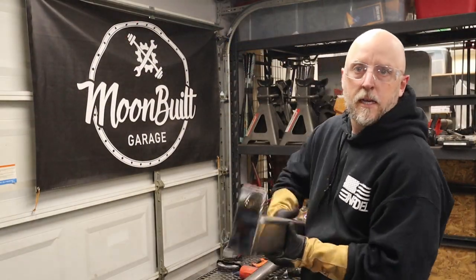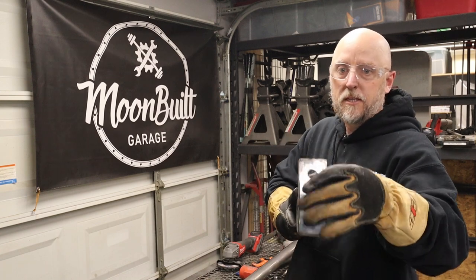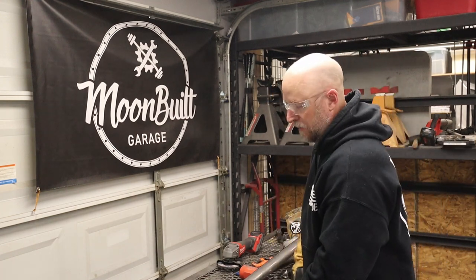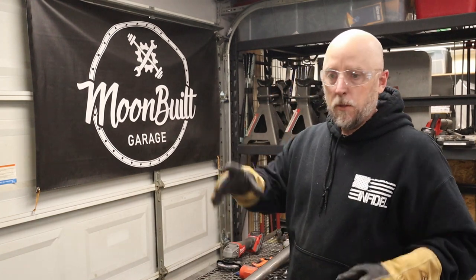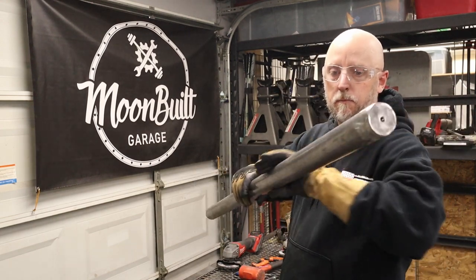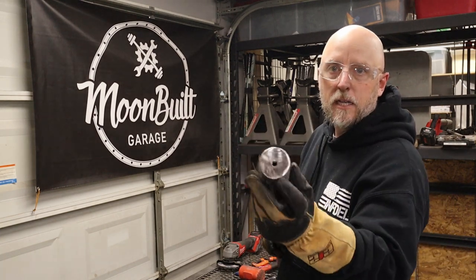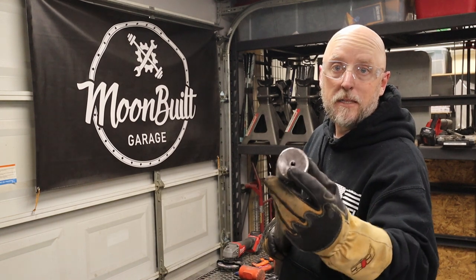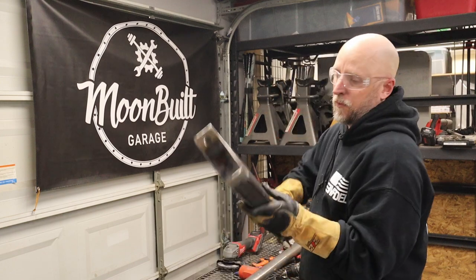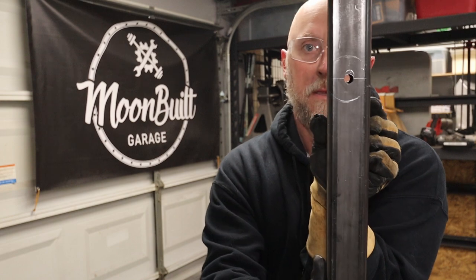All right, so once I got the end plate all welded on and got the hole drilled and everything, and this is, like I said, where your chain goes off of your belt to do your squats, it was time to work on the pole to hold the plates. So I took some 2-inch tube, cut some 3/8 plate to size, and I drilled and tapped the end for a 3/8 16 bolt. And then I just drilled through both sides of the tube there.